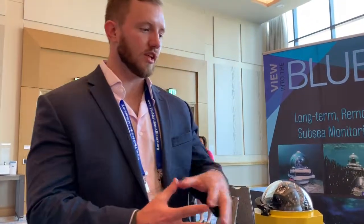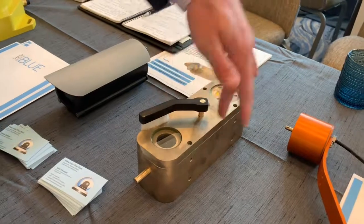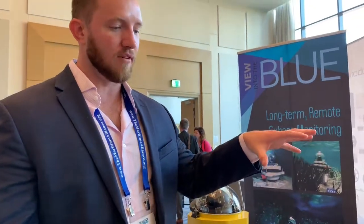During your presentation I had actually seen the anti-fouling product mentioned and I wanted to ask you about it in person. So we try to make sure — this part is actually a bronze material. Bronze in the water column is just a natural deterrent for marine growth. They don't like it, they hate it — just the same way that a penny thrown in water turns green. So we try to stay more on the physical side of deterrent and anti-fouling versus a chemical side.